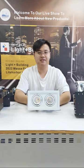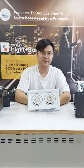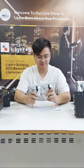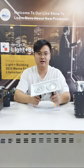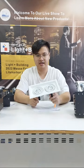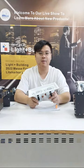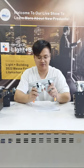And the CRI is more than 90. CRI means that the light can make the products look more colorful and close to natural. In clothing stores, malls or some commercial lighting projects, those projects always require CRI more than 90 and 3 SDCM or 5 SDCM. This is an important sales point to get the general contractors' approval.